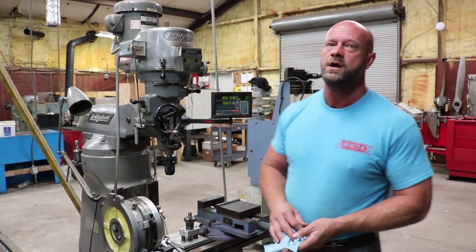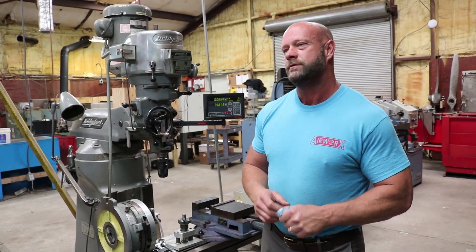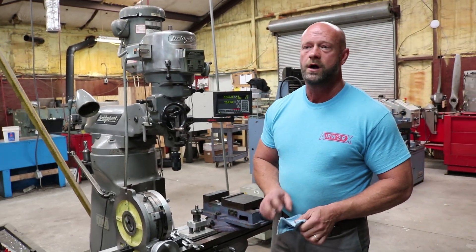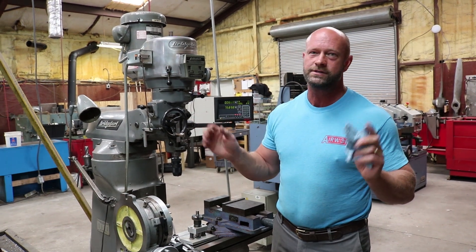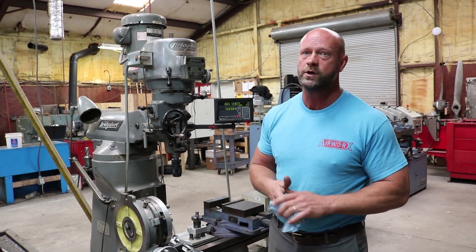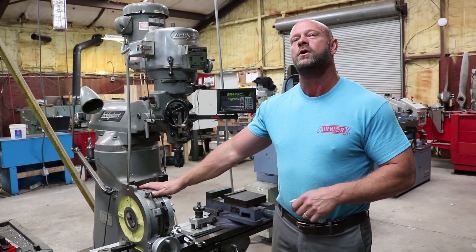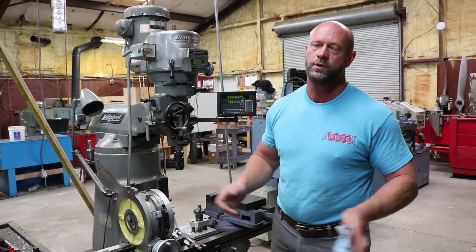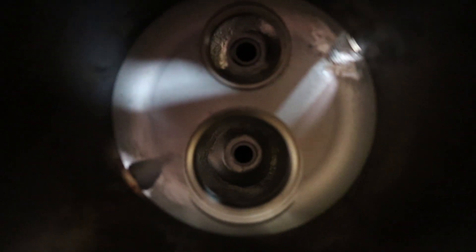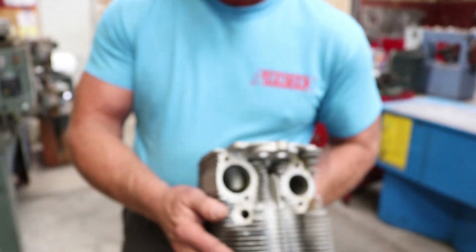We use the Bridgeport machine for a few different things. A lot of these cylinders are 70-plus years old and people end up pulling helicoils out of them and trying to put bushings or keen-certs back in — I've seen all kinds of repairs. We actually take those, pull all that out, taper the hole, preheat the parts in the oven, and do a plug weld with the TIG machine — we're certified welders. We go in and plug weld those holes up, put them on the Bridgeport milling machine on the turntable, remachine those spark plug holes out, and put a brand new stainless helicoil in just like they were from the factory.